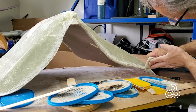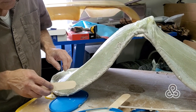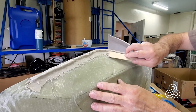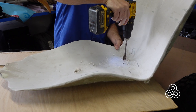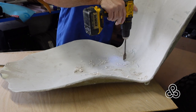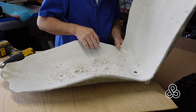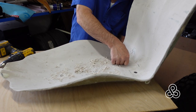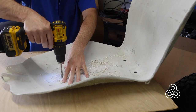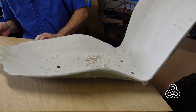Squeegee that out, take a little spatula tool, and work it in. Pretty rough, but as with everything on a project like this, it just takes a little sanding to fix that. It gives us a nice little beaded edge. I'm also going to take this thing — still semi-flexible — so we're going to mount it to a couple of pieces of plywood. Create a couple of insets, stick some wide-flanged bolts, punch them through the plywood on the backside, and bolt it to there. That will hold the whole assembly stiff and rigid.